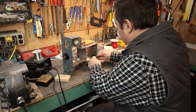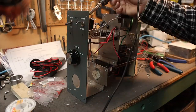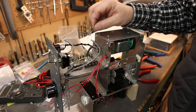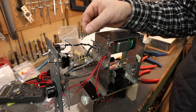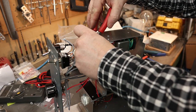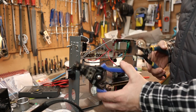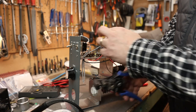Wiring up the tube sockets - one thing I like to stress is you should make a mechanical connection to the tab of the tube socket. Some people will just solder the lead directly on and you get a bad solder joint. Instead, make a little loop, hook it through the hole, pinch it with needle nose pliers, and then make the solder joint - so you have both a mechanical and a solder connection. I use two types of wire strippers: normal ones with a cutter, and another kind that holds the cable and allows you to strip it - much easier in tight spaces.